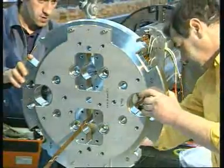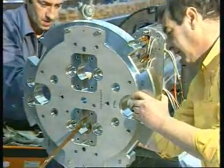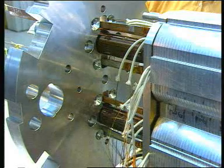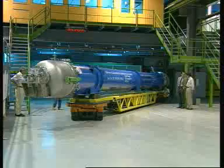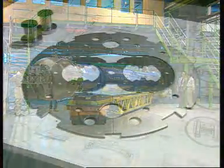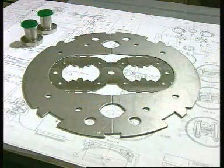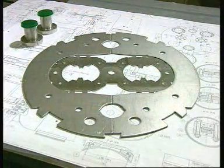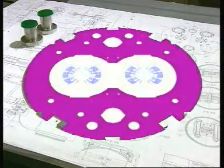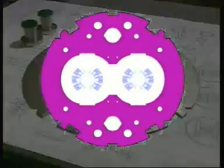Inside the dipole, the different parts of which it's composed always surprise people by their size, reminding them that it has to resist the force of 400 tons per meter. Each of the LHC's components has been designed and produced with these extreme conditions of use in mind — particularly the tightening collars, which were designed using computer simulation techniques to determine the constraint zones and optimize their shape.